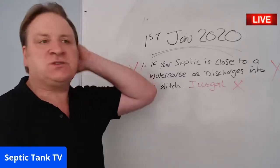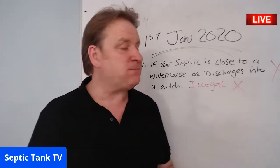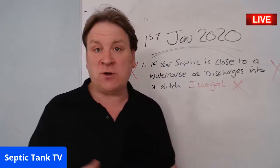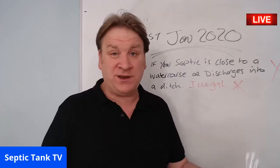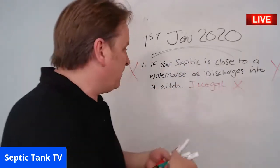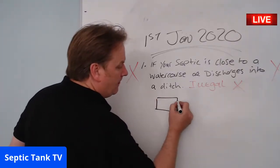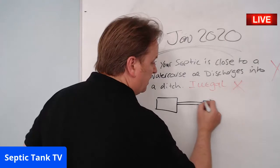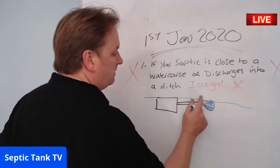You've got three options: you can relocate your septic tank and soakaway, or replace the septic tank and soakaway — either of those will cost anywhere from £8,000 to £12,000. Or you can go for a septic tank converter, which typically costs about £3,000–£4,000. You just dig a small hole, put it in, and leave your existing septic tank in place.